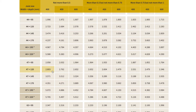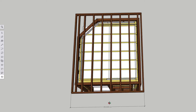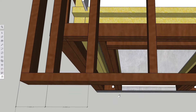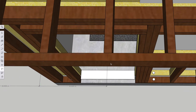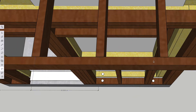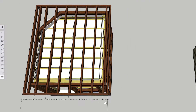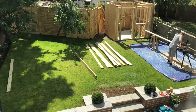I'm actually using 47 by 125 timbers as it was the closest fit I could find from my timber yard, and it's always better to go slightly bigger than smaller. I just wanted to quickly show you how I've calculated all the measurements in SketchUp before cutting any wood. One technique I follow is to mark centers and then align the center of the stud or joist to these markings when fixing, rather than marking the edges of each stud. The wood isn't exactly cut to the size specified — often known as nominal versus actual — so by working from centers it doesn't matter how thick the timber is; I'll always have the correct equal spacing.